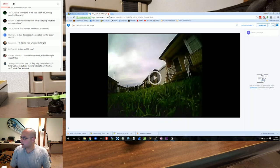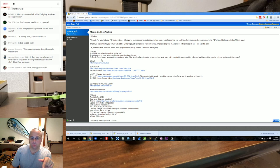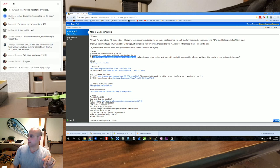All right, well, since you're here, let me know. Anything else? The buzzer should be 5 volts. But here's the thing. You hook the buzzer up to the positive line. With the buzzer, the negative is switched. The positive is whatever you put it on.